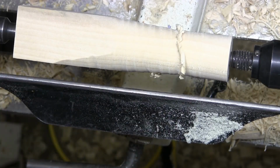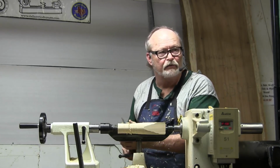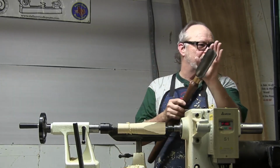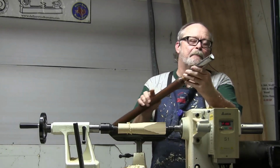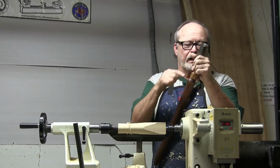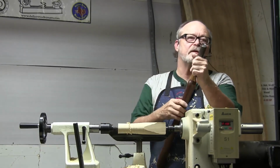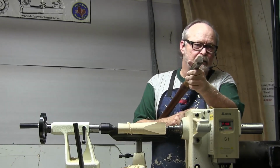And if I did the same moves with my roughing gouge, you know what it would do? It'd just keep going. It's very hard to get a run-back or a dig-in with one of these. This tool I start everybody on, usually people new to woodturning, even little kids or adults. Not a bowl turning tool. You'll break them right here. Don't anybody kid you about that. I carry one around with me that's sheared off. Somebody snapped it in bowl turning. They're not for bowl turning.